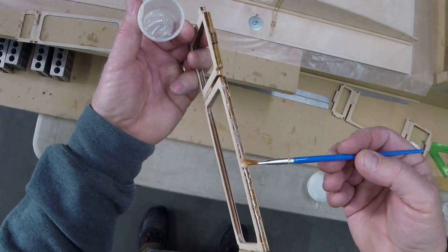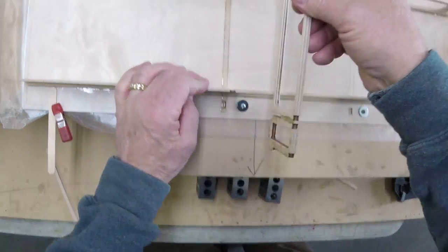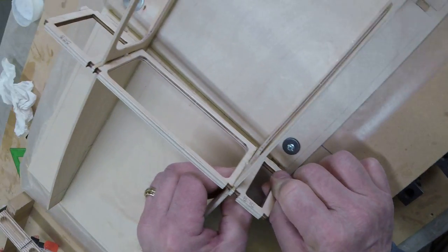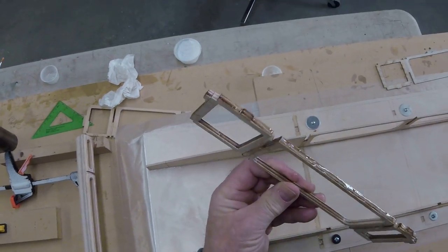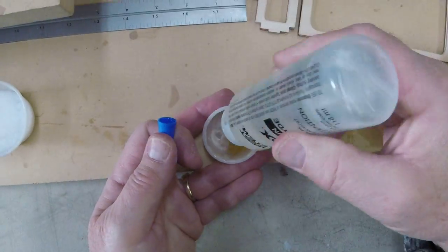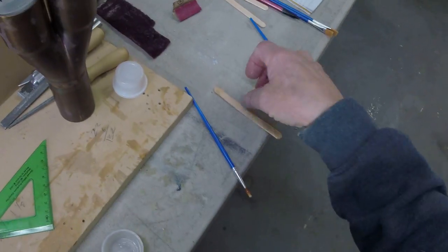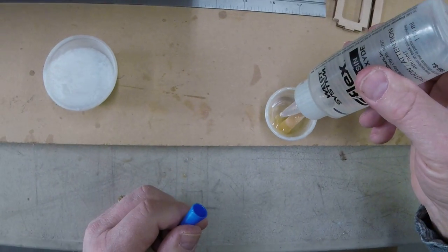This piece is nice and straight; it will stay where I ask it to. Oh, I forgot to apply a little epoxy on the end here — we do need that, because there's a lot of twist taking place on that transom and all this piece is doing is butting up against it. It doesn't interlock, so let's make sure we attach it well. Maybe we need to do a live stream where you guys can tell me what I'm doing — I think that last bit was a little short on resin. I did too.